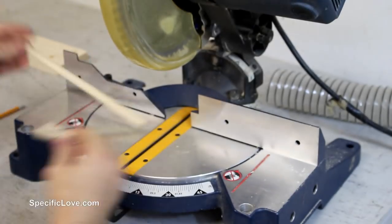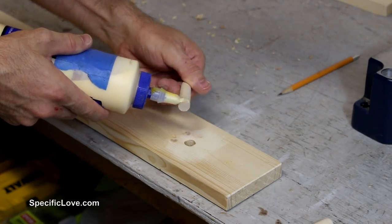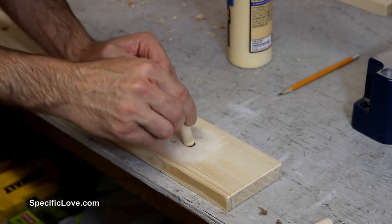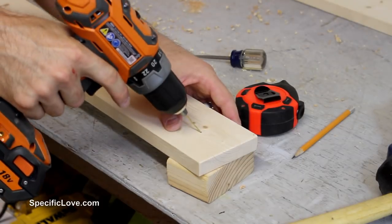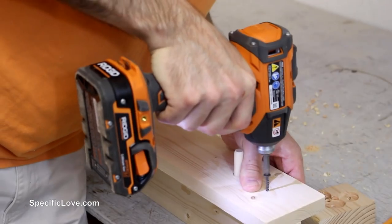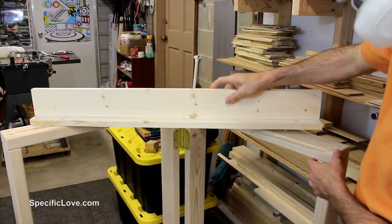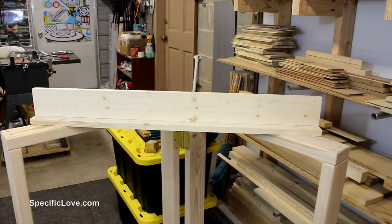I next chopped the dowel to about 2 inches long — you will need two of these. I then glued each of the dowels into the bottom of the signed base holes. Next, I pre-drilled four center holes in the signed base and screwed the base to the edge of the top sign board. Now the signed piece should be able to slide into the hole provided on the frame to hold everything secure.